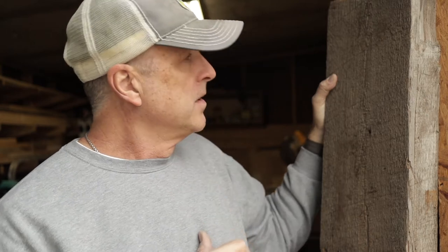I know that you can sand it down and give it a totally different look, but my goal is to maintain some of this gray patina. When I sand it down to knock the edges off and get it where you can finish it, it's gonna change the color and probably brighten it up some — but I'm gonna do just as little as possible, giving it a smooth finish and then maybe a matte polyurethane. One benefit I have is this piece is longer than I need. I've got roughly a foot — what will end up being a couple of six-inch pieces — that I'll cut off and use to experiment with the sanding and clear coat before I install the final mantle.